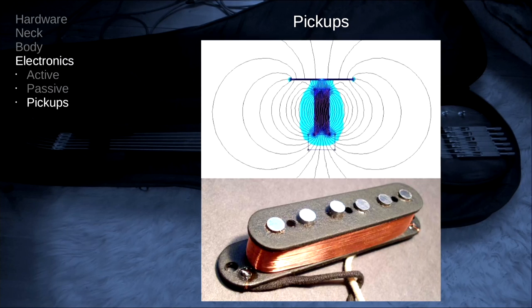There's the electronics. They were boring, let's be honest. The most interesting stuff are the coils, the actual pickups. You see there's this coil, so there's just copper wire wrapped around a magnet. And yeah, you see six magnets here, but those actually act like one huge magnet. And so a pickup can't distinguish between the individual strings. That's also why the Moog guitar uses optical pickups, because with that you can actually distinguish between the different strings, and you don't have to go into weird Fourier transformations and analysis of overtones and stuff like that.